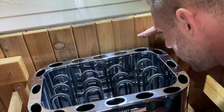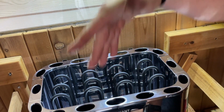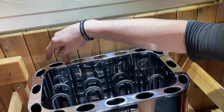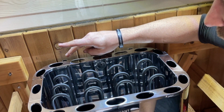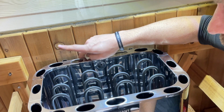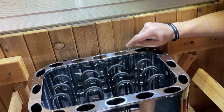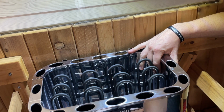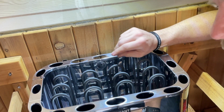Looks great. Okay, I just wanted to pop in here really quick. So this measures 19.5 inches all the way down from the bottom of the base to the top. And for the mount for the other sauna, it's a little narrower. So what I did was I took the calculations of the top to the bottom, which is 5.5 inches from the top to the bottom of that second bolt. And for the weight of this and the thickness of the screw that we have, it's actually doing a really good job holding it up. So just make sure to pre-drill. You don't want this kind of wood to split, so pre-drilling in this wood is imperative.